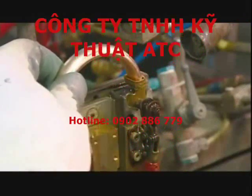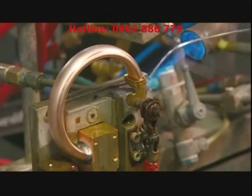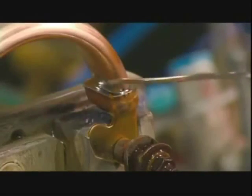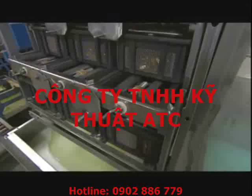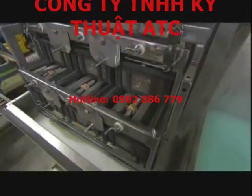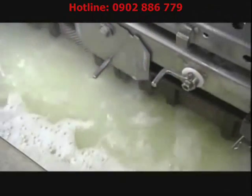He puts the cooled piece on a mounting fixture and solders the other end of the bourdon tube to the gauge's internal mechanism. He seals the gap and cools it down. Then he puts the finished pieces — now called pressure system assemblies — into a cleaning machine, where hot, soapy water washes away any dirt and loose solder particles.